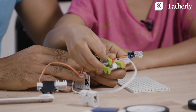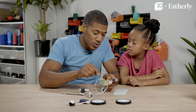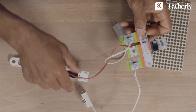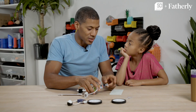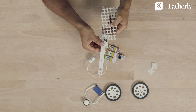Now this is very important. We have to make sure the motors are connected to VAR. There's a little switch here, and the servo needs to be set to swing. That way it'll go. So now that that is done, it's time to start putting things on the mounting board. First we're going to put on the servo.